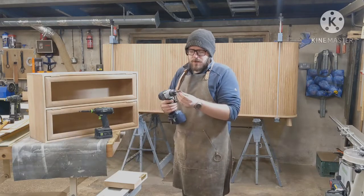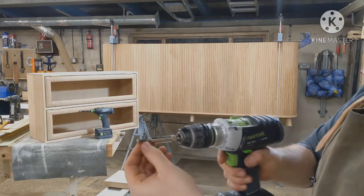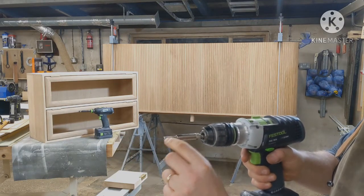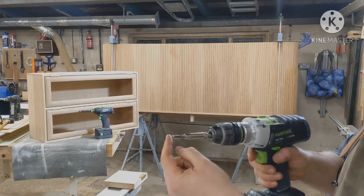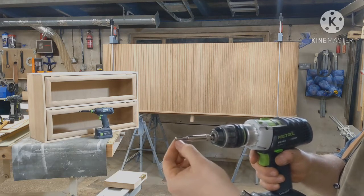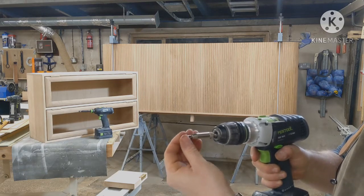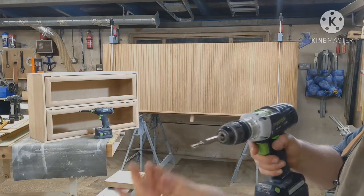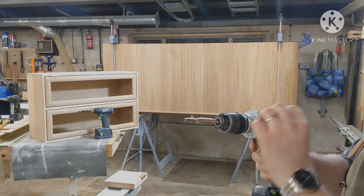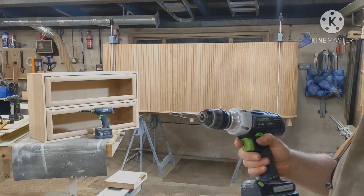As you're drilling holes, this cage-type arrangement that goes around the outside of the bit — there's not an awful lot of clearance between that and the pilot bit. What you tend to find is, especially with hardwoods, not so much MDF or something because it's more particulate rather than fibrous, it just bungs up in here and then your bit gets stuck. You don't notice and it's just a pain. Every one I've ever owned, I've had a few different brands, they're all based around this design. They've all been the same, so you just kind of accept it as the nature of the beast.